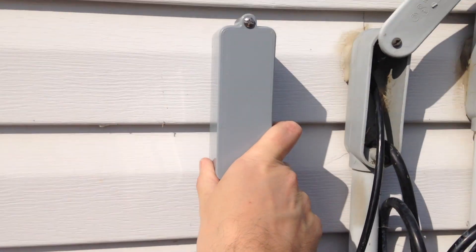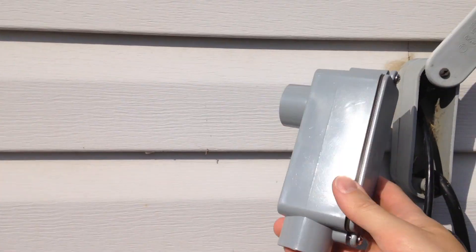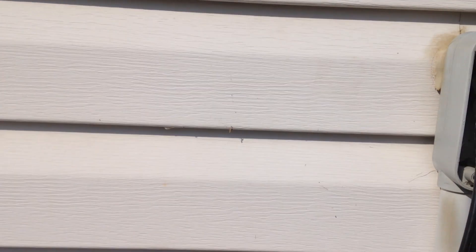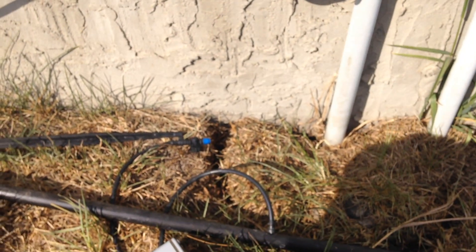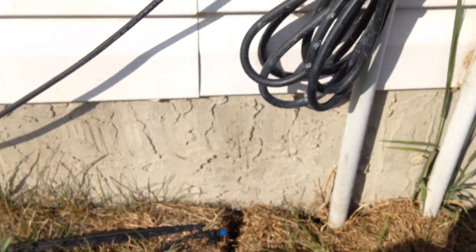The plan is to use the new box just for the cameras. On the inside I'll attach conduit to the siding, then have a pipe running down to the ground here, and have the wires running underground to the appropriate spots that I need them.